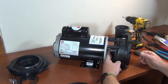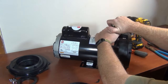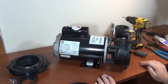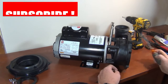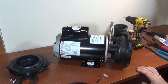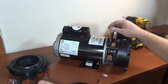We're gonna put vice grips on there. Some pumps are all enclosed and you can't get in there. If you have that style, you can see the fans inside — put several screwdrivers in between them to hold the shaft. I have broken fan blades off doing that, which is not good, but it can work. For this style we're using vice grips because we can access the shaft.